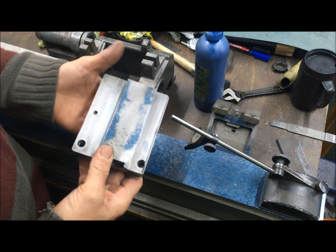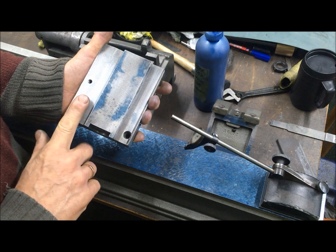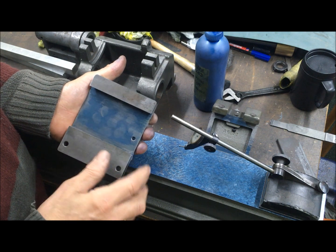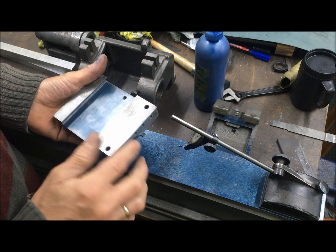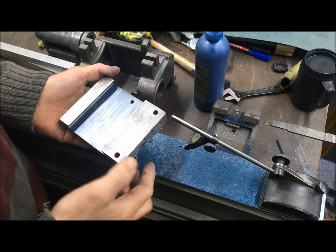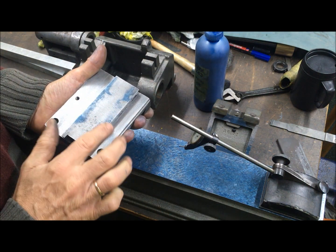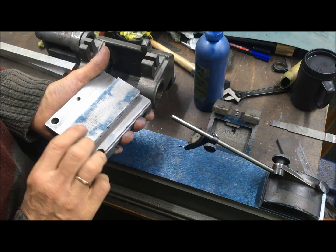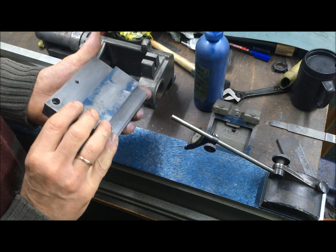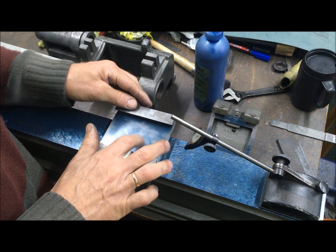This area is responsible for most of the wear — no ridge here. This drops, but it was primarily due to this area here dropping. I've measured this in comparison to these surfaces, and also put it down here and measured on top. Within reasonable deviations, these are not much worn, and they are flat.